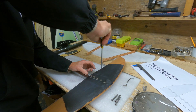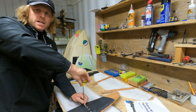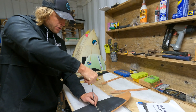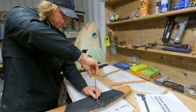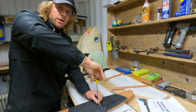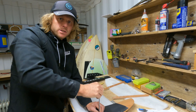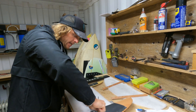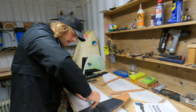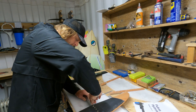That is all working. The first time putting the screws in they can feel a little tight, mainly because we've just tapped them and haven't got all the thread dust out yet. That's why you blow the WD-40 through it and try to clean those threads out. When you take this out for the first time, you want to only fly it for about half an hour and then come in and tighten these screws up again. For the first couple of sessions, periodically tighten the screws to make sure that if they're compressing at all under load, you come back and tighten them up so the whole assembly doesn't get loose. You definitely don't want to fly the foil if the screws aren't tight.